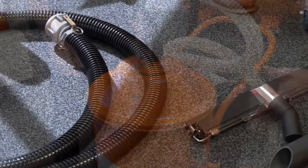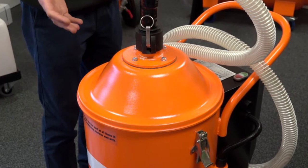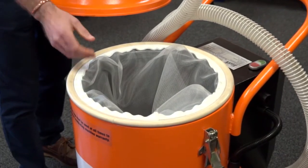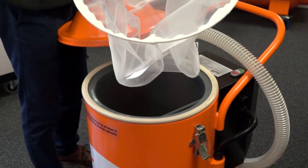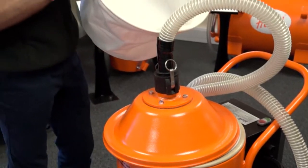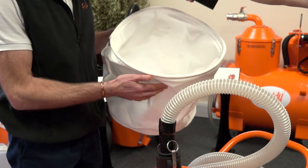In terms of the basket technology and accessories on the floor — this model has a 38mm toolkit, but we also have the same toolkit in 2 inch or 51mm, which is the same as the rest of the range. Underneath, the basket and filter — we have a range of filters from 1 micron through to 1000 micron. The 1 micron filter is used in the jewellery quarter to pick up precious metals like gold and platinum, and then they burn the bag to reclaim the metal.